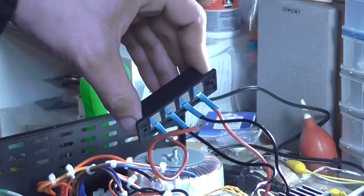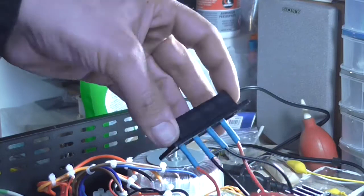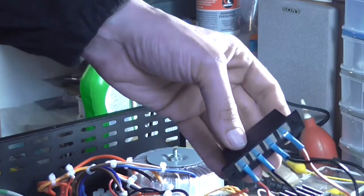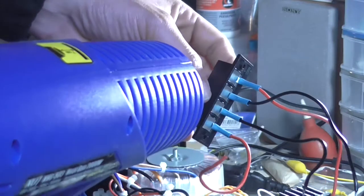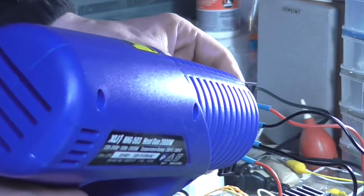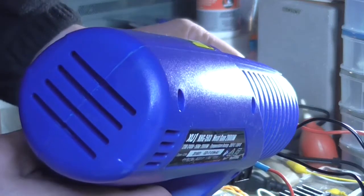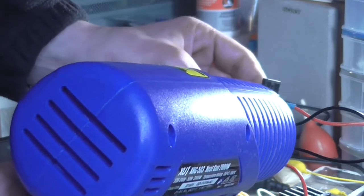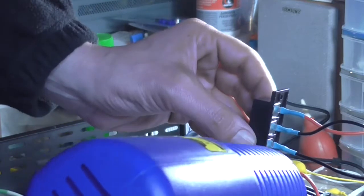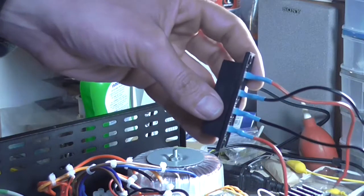Okay, so after doing some wiring, I've got some progress. I'm just doing the speaker connector because it's easier to connect the speaker leads to a connector rather than have them just flying around. Just wanted to show a pretty simple way of doing heat shrinking. So I've got my heat shrink on the connector and I've got my heat gun. I'm going to use the low setting, and just like magic, it's heat shrunk to what it needs to be.